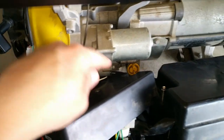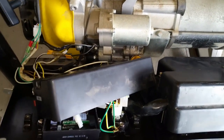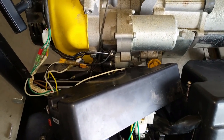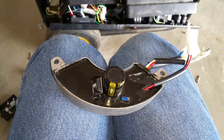Finally on the bottom is a yellow wire that goes inside the engine block — that's for the low oil sensor. The low oil sensor is a little bit of a pain to get to, but essentially if it doesn't sense pressure inside the crankcase while running, it'll tell this board to ground out the ignition and shut down the engine so you don't damage it.